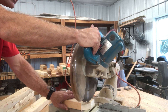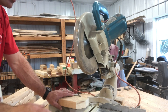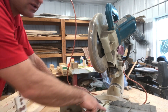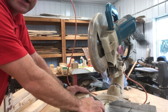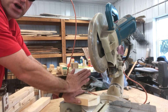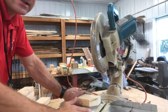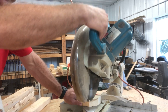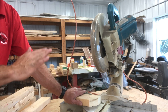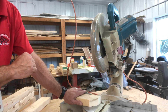When I make this cut, I go down nice and slow, let it come to a stop, then get my lumber out. Make sure your fingers never get into the blade area — that plastic piece there. Hands should be over here, away from the blade, holding the lumber against the fence. If it's a long piece, this is an extended table so you can cut longer stuff — come all the way out, then down, then push in nice and slow. We're not in a rush; rushing with power tools is how accidents happen, and you'll regret it.